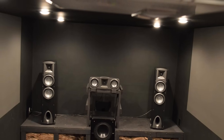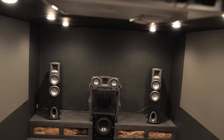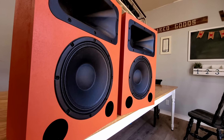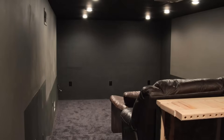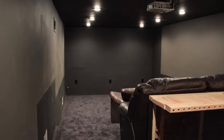This was just a really great project. With that wide off-axis response, it's going to work really well as a surround, but it's also going to work great as a center channel — and honestly, that's where I see this really thriving. Typically with a center channel, when you move to the right or left, your sound starts to suffer, especially with rectangular designs. This speaker guarantees the exact same sound in every seat in your theater. It also has really great vertical off-axis response, so if you have a multi-tier configuration, that's another place where this will excel as a center channel. This was also my very first time using Celestion drivers in a home theater build like this, and I couldn't be happier with the components and waveguide we chose.